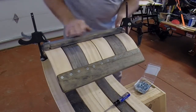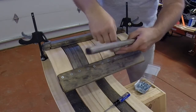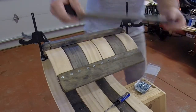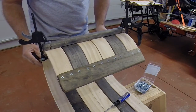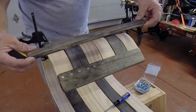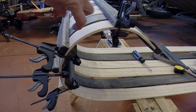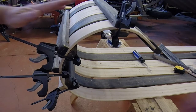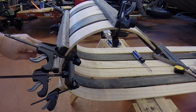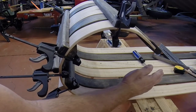The next step is to put our bumper board on. On my design and form, I measure over twelve and a half inches and that gives me exactly center of the curve to put my bumper board on — on the outside of the toboggan. That way if you're going down the hill and you hit anything, this will help protect your toboggan. I've put a bunch of crossmembers on here with clamps, holding all these boards together and keeping them as fair as I can across the toboggan to screw in this bumper board. As soon as I get all the screws in, I'll take all these clamps off and then we'll start doing our crossmembers down the rest of the length.